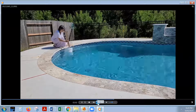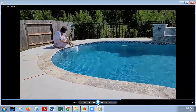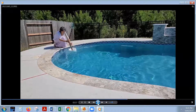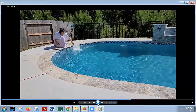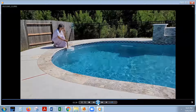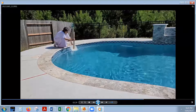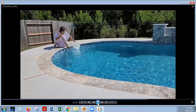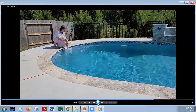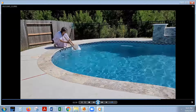I'm not going to pour it into the skimmer. I've got the granular calcium in a bucket and I'm adding water — this becomes really hot. In fact, the first time you add water it literally boils right in front of your eyes, just bubbles. I'm going to add it to the pool in the deep end near the drain — those are actually suction ports, not real drains. I pour it in slowly and gradually; it dissolves very easily and gets really hot, so the best place to put that bucket is in the large cool container, which is the pool itself.